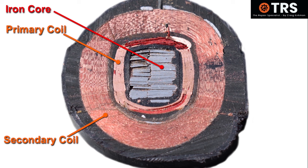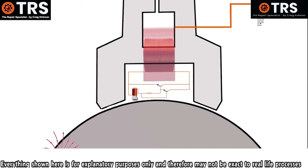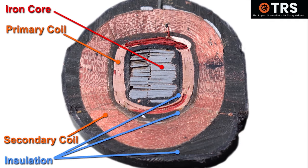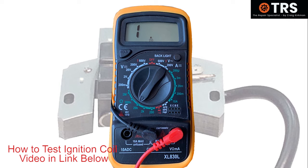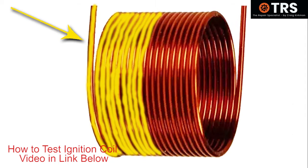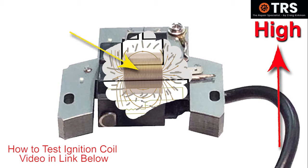So from what I've mentioned in this video, most of the reasons why a coil goes bad is because the insulation is somehow damaged and loses its integrity. We now know there are certain things outside and inside the coil that can cause this. If you suspect your coil is at fault, a good way to test it is using a multimeter on the ohms setting to make sure the resistance through the coil is not too high — because resistance that is too high will cause heat within the coil and ultimately reveals that the coil has already gone bad, with something having gone wrong inside for the resistance to be that high.